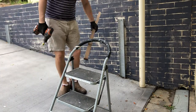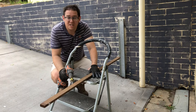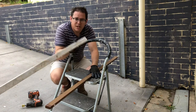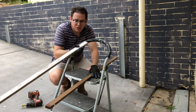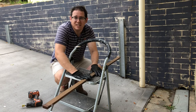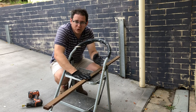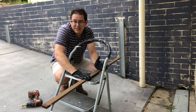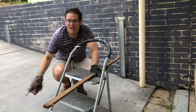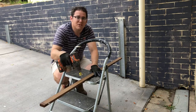When selecting your scrap timber, just have a think. For the outside, I'm using some Merbau screening I have lying around, because it's very weather-resistant. For the inside, where moisture isn't as much of an issue, I'm using a piece of moulding or skirting board. You don't really need to cut them to size as long as they're shorter than the opening of your garage door — you can use multiple pieces. Keep in mind this should be basically all unseen, so just choose what will work for you. It's also advisable to pre-drill if you can — it saves hassle when you're up there, especially with hardwood.